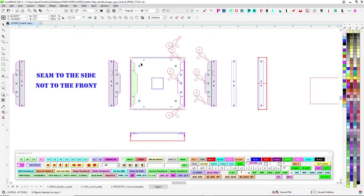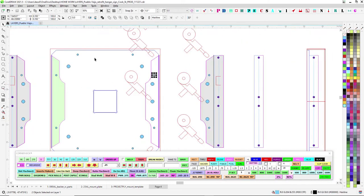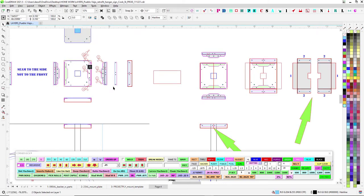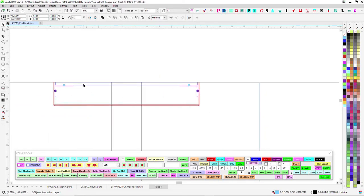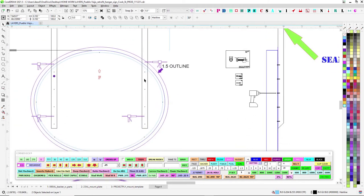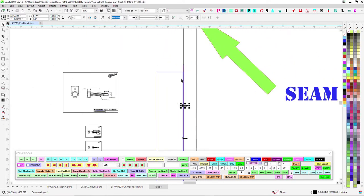I have them on all four sides to make these universal, but make sure you are 90 degrees to your 45. The side gets that little mounting plate thing. I've got big-boy clecos — these are 193s — so it's easier to just cleco them on, tack them. I've got little plug welds here; tack them on both sides. From a side profile you'll see it tacks there, comes down, and the screws will be on the side, coming from the front and back. Burn the plates, get the mount things on there, and then Loctite them and cleco them on — that handles putting the legs onto the backer.